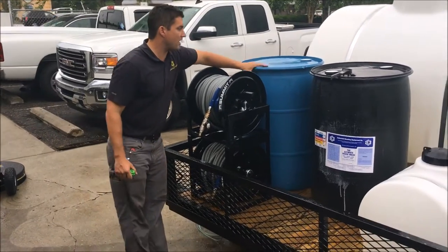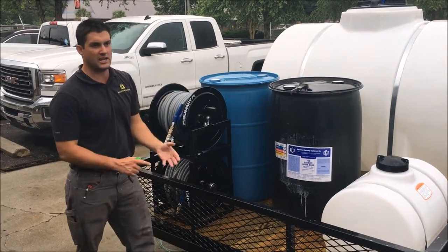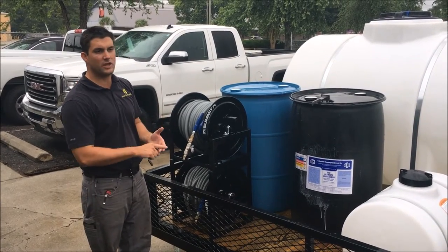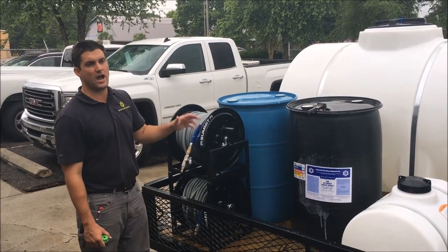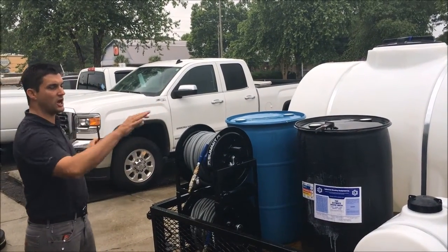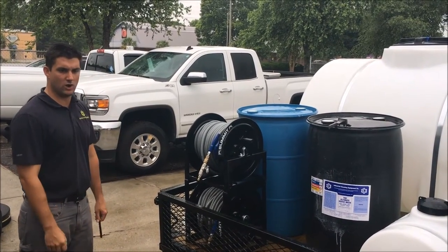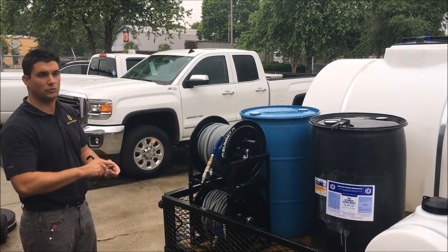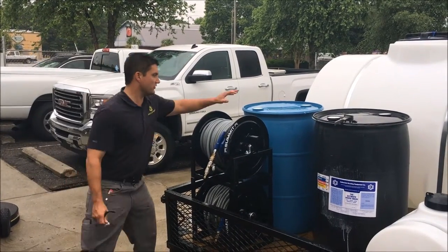This customer has also got two types of chemical, the Ultimate House Wash, which is our number one selling product for cleaning any exteriors of homes, wood, vinyl siding, porches, roofs, anything on the exterior of homes. The only thing that you want to be mindful of is you don't want it to dry on glass. So if you wet it down beforehand, and how I'll do everything is any vegetation I'll wet down, apply the chemical, and then rinse back, and I'll rinse the vegetation as well because it has sodium in it. There is a chance it could brown some plants, but any kind of mold, mildew, algae, weather film, it brings surfaces back.